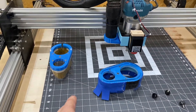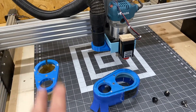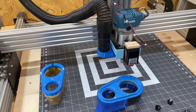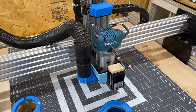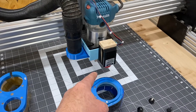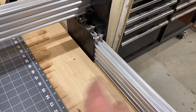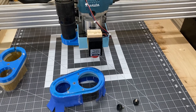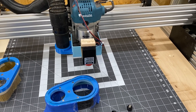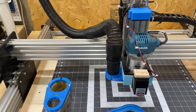I really hope you take the time to print your own — I think you'll find this setup will reduce your dust problems altogether. I've been very impressed with it. I've routed about three-eighths deep with a V-bit making signs and seen nothing in the channel area. I was about to add angle brackets along here to protect the channels from dust, but I'm not getting any of that at the moment, so I don't see a need for anything beyond the shoe and vacuum system.